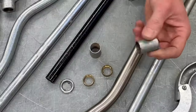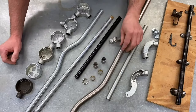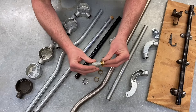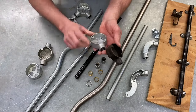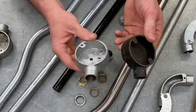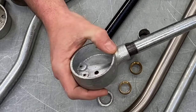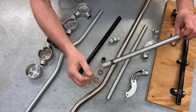We'll name a couple of other accessories. We've got couplers, female bushes, and lock rings. Here's a male bush and a female bush - we'll be using both of those in the workshop exercises to connect conduit, for example between a box and a coupler. We've got lock rings and lock nuts. We also have a black enamel and a galvanized box - this is often called an end box, but the proper term is a terminal or termination box. They've got a pre-threaded spout, so the conduit itself is threaded and winds into the spout, then tightened off to make the connection.